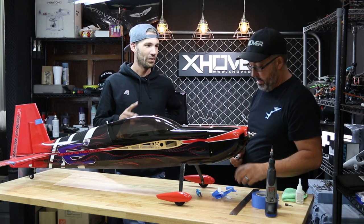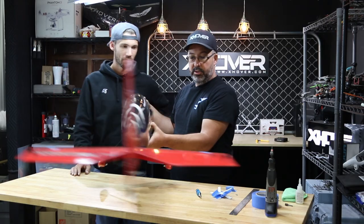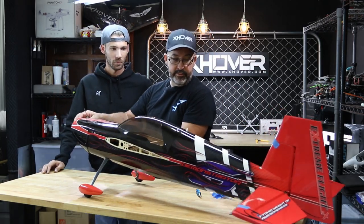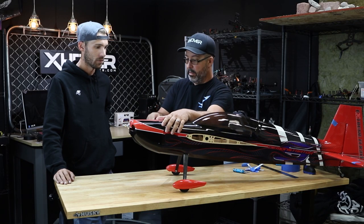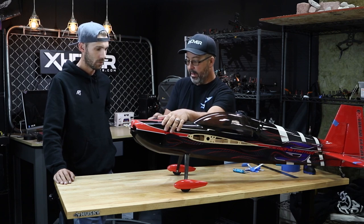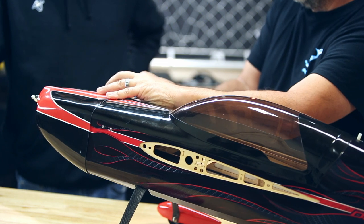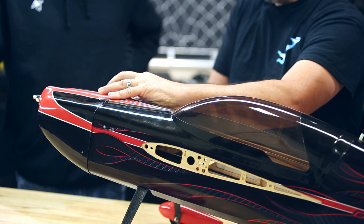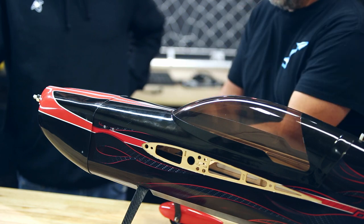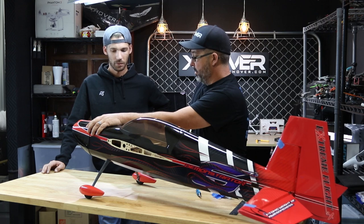Do you only do that once? Yep, just do it once, the first time. You'll take this off, put one or two drops in, let it cure for 15-20 minutes, then put your screws in and you're done. You can do it as you thread it in just to act as Loctite for the screws as well, but these wood screws going into the ply generally won't back out. By putting the thin CA it tightens the tolerances and works like Loctite.